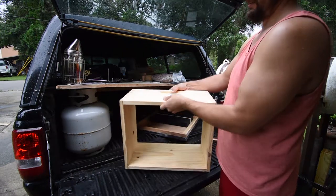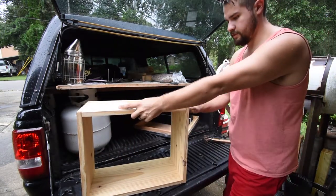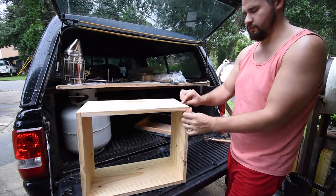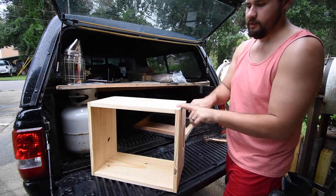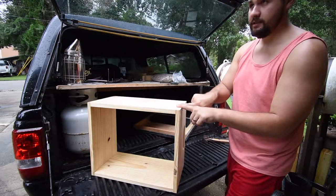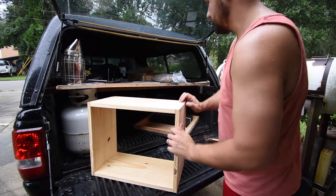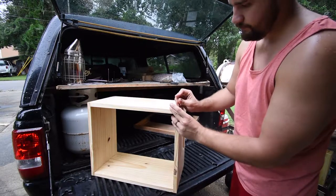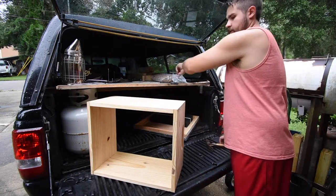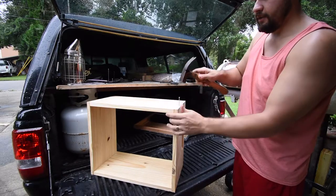Now I'm gonna move on to the sides, these right here. One thing I love about the box joints and nails is that the box joints reinforce the fibers of the corners. When you're sinking a nail, the wood tends to want to split, but these box joints are reinforcing that and keeping it from happening. And these nails are actually expanding the fibers ever so slightly, which is why you can't just put two pieces of pine together and nail them like this.